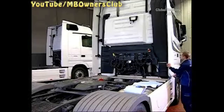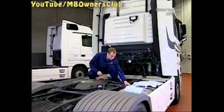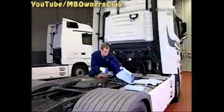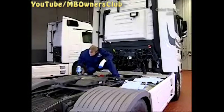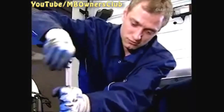The star of today's show is the Actros, and the new guide plates to be installed. Start by taking off the old guide plates. Wear gloves for this job. Because the semi-trailer is greased, this grease also gets onto the guide plates, so clean the guide plates with a cloth. This makes access to the screws easier. With suitable tools, remove the guide plate screws. There are six screws per plate. Once you've removed all the screws, take the guide plates and put them aside.